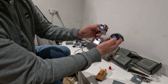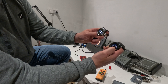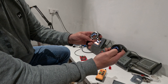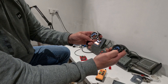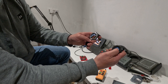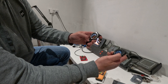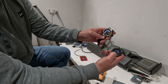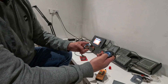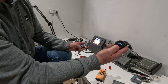If we go to Data Display, this is now going to show us the incoming data. Wind angle, wind speed — 11 knots at 20 degrees — depth at 1.2 meters, speed over ground 6 knots, speed through water 5 knots, course over ground 56, heading 55. So that's all our data coming through. We are in business — this is basically replicating everything, so all the data that's on my boat or on my SeaTalk bus, I can get it right on my watch.